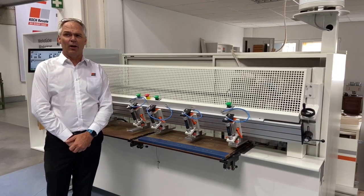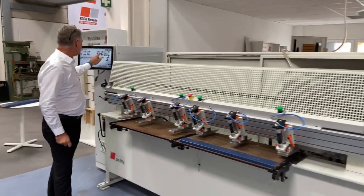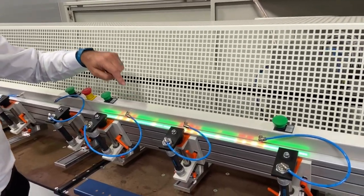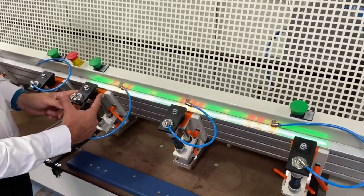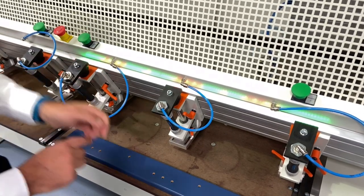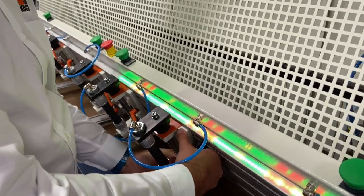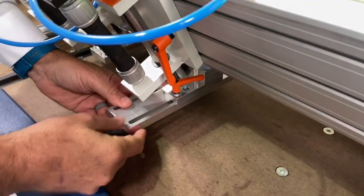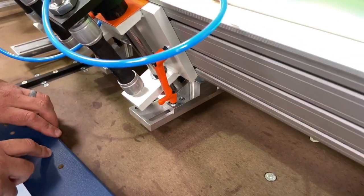Our latest development in the optional narrow part package comes with the new LED clamping positioning setup for vertical drilling. Three different LEDs are displayed: green, red, and orange. Green allows you to position the clamp using the indicator bar anywhere in the green section without danger of drilling into the clamp. Red is a no-entry zone where the clamp may not be positioned. Orange is a zone whereby the depth of the Z-axis can be adjusted safely to ensure that the drilling does not touch the clamp. Special care needs to be taken not to position it any deeper than that.